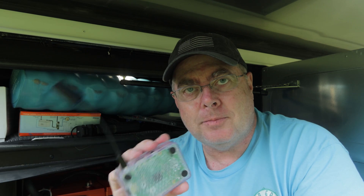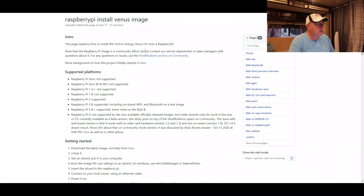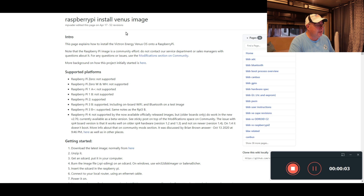Let's take about five minutes and build this Raspberry Pi and install the software, then we'll come right back here. I've got the computer set up with a hard-wire to the Raspberry Pi into my router, because you need to set up Bluetooth somehow. You can also connect a USB monitor and keyboard/mouse directly, but we're just going to do it remotely. The first thing we have to do is install the OS on the SD card — this is 128 gig, simply because I had it laying around. Links to all this stuff are in the description below. We go to the Raspberry Pi install Venus image page, which gives you step-by-step instructions.